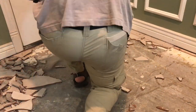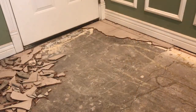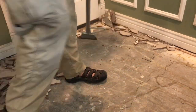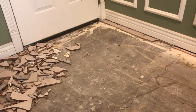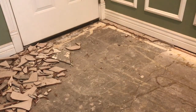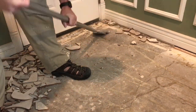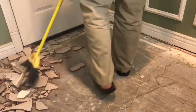For a $20 scraper this worked great for a small kitchen and dining room, which was about 150 square feet combined, plus this entryway. However, using it did wear me out and I had to take several breaks. Adding up just the actual work time, it probably took about two hours to get all of the tile out of the kitchen and dining area, and it took a little over six minutes to remove this entryway, which I sped up to spare you five minutes.